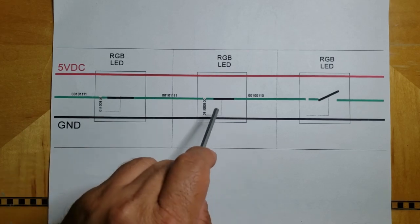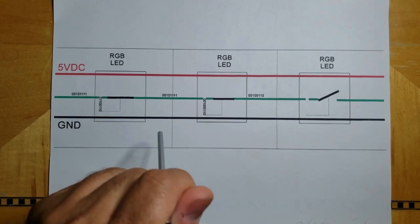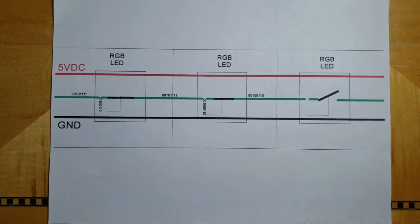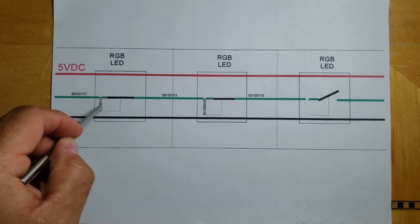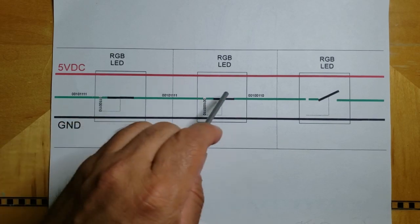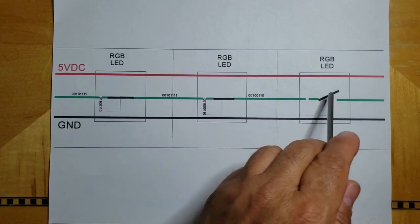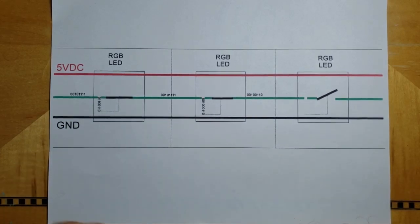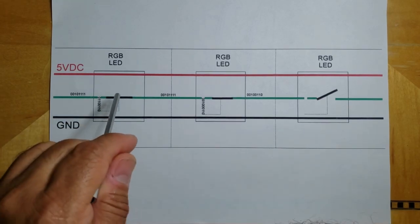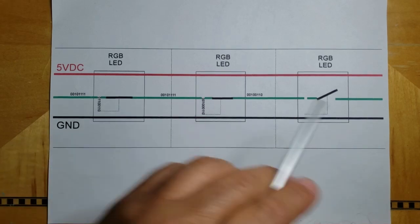So each one of these LEDs is programmed to listen for that silence, and when it hears no data coming through for that specified amount of time, all of these packages that were sitting here holding these doors closed are dumped. So this package will fall off, this package will fall off, and all the doors will now resume to this position. And then you start the whole process over again. So every time that you send this blast of information through, you're potentially changing the color and intensity of each one of these LEDs. And you're doing this in rapid succession.